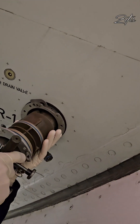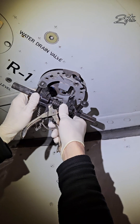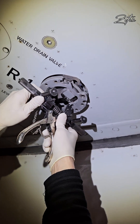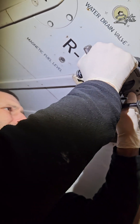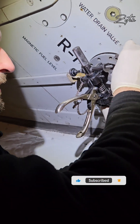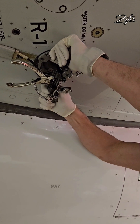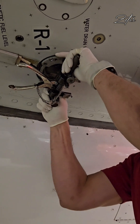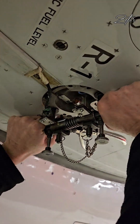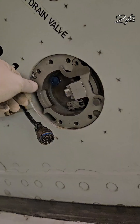We can proceed with the installation, but keep in mind which way the connector is pointing because the pump can be installed both ways. Then push the pump inside the sliding valve and with the help of the extractor turn the pump clockwise until the stop pin in the sliding valve aligns with the stop pin hole location in the canister. After that turn the baulk arm into the closed position and push the pump with the sliding valve into the canister.